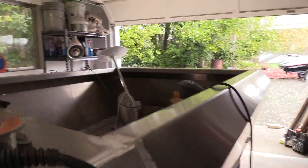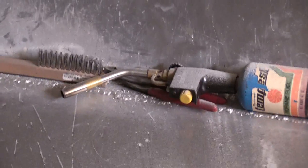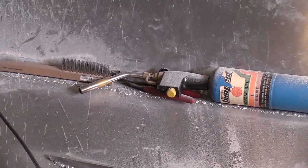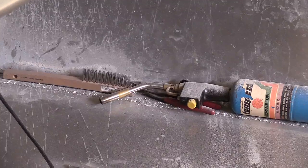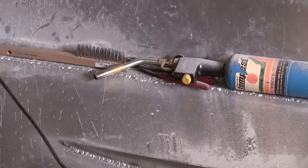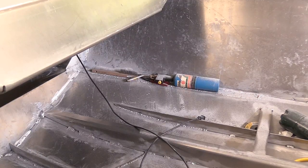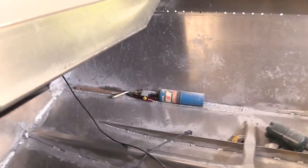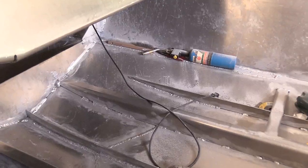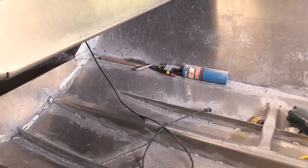A lot of using stainless steel hand brushes — that's my little welding kit right there. Essentially: putting heat to it, getting the moisture out, getting it clean. And even after you brush it, you've got to blow it off because it still has carbon where you brushed. And that's not even including what a lot of people might recommend — using acetone and cleaning it after brushing before you weld.